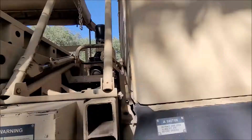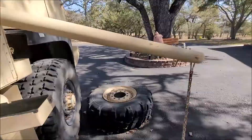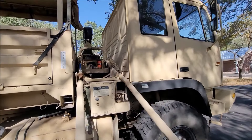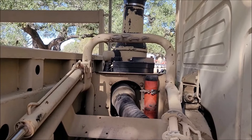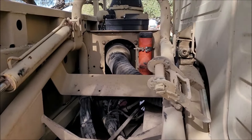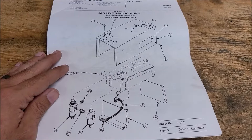It's working now — and then a little bit after the pressure, it pulls that pin in, which is what it's supposed to do. Very happy. The only thing is I haven't put the cover back on because there's hydraulic fluid everywhere and I want to make sure it's not going to leak. I may also degrease everything below it since all that area from the old leaks is really nasty.